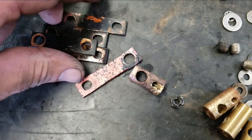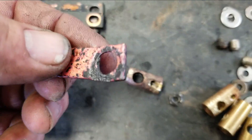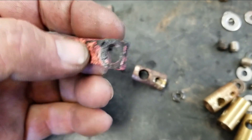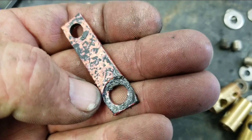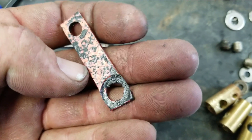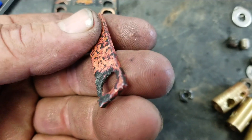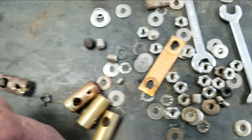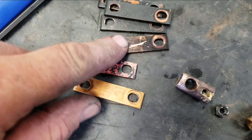Here are all the copper jumpers — these are all pretty good, just run a piece of sandpaper over them and ready to go. This one is so pitted — look at that. Right here is where it was over that terminal. You saw where the porcelain had welding spatter on it — those little bits of copper that impaled themselves into the porcelain. So this one is going to get replaced obviously. That was the one good one; all the others were discolored from heat.